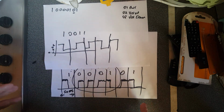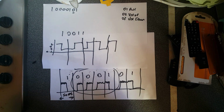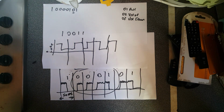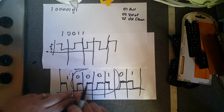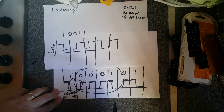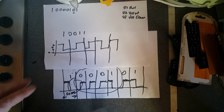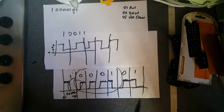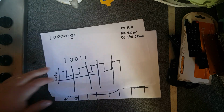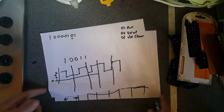Now in reality, the more modern remote controls use a much more sophisticated protocol. For example, the NEC protocol actually sends a device code at the start, so only certain devices will recognize that signal. You'd fit a device code in somewhere here, and multiple devices could see the remote signal, but unless they recognize that device code, they'll just ignore it. The Philips RC5 protocol, which is what I'm largely basing this talk on, was designed so that one remote control would operate any CD player or any television that uses the RC5 protocol. So there are benefits and disadvantages.